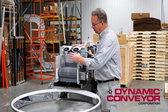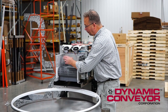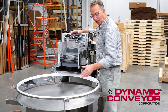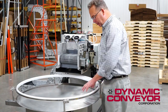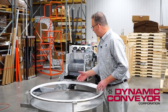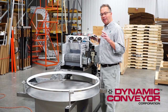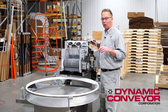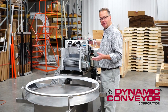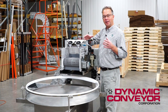After the parts are dried, or at least the water stripped off with the air cannons, they fall onto this accumulation table. There's a person here to pack out and there's another person over there to pack out. This is a pretty simple setup, but it's a system that just with two conveyors doesn't work — we don't cool, we don't dry, and we don't accumulate. Adding these three other pieces of equipment takes it from a conveyor to an integrated conveyor system.